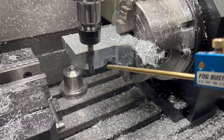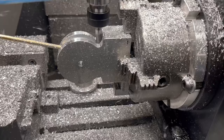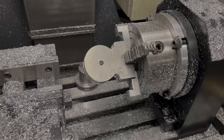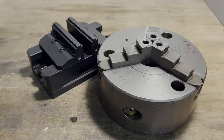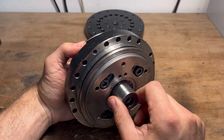The process of custom building this joint showcased the versatility of my fourth axis. I was able to machine all sides of the part with a single clamp, simply by rotating it. But in terms of fourth axis workholding, a setup like this is much more appropriate. Hence, in this video, we'll be crafting a faceplate that accommodates both of these setups.